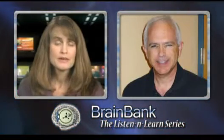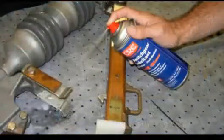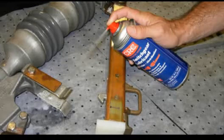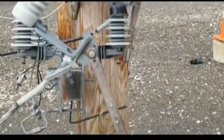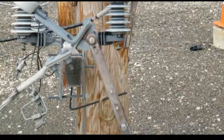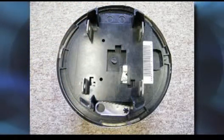Can you elaborate on why contacts need to be lubricated? Lubrication on a switch allows contact surfaces under pressure against each other to move while maintaining circuit integrity. In a utility high-voltage switch, that blade has to open in a very controlled manner until line break, at which point an arc is safely achieved. Otherwise, a blade switch can jerk, stick, or even break, causing arcing or faults. In meters, it allows easier insertion into base clips and long-lasting protection of that meter junction.